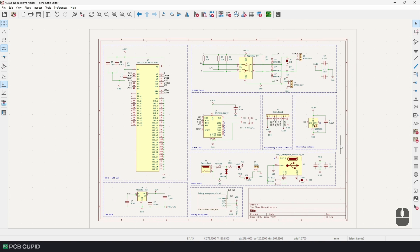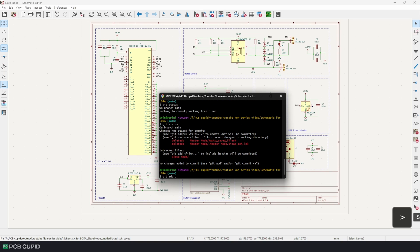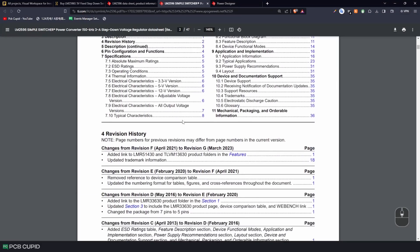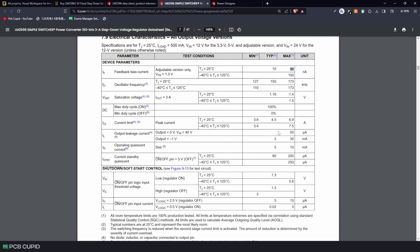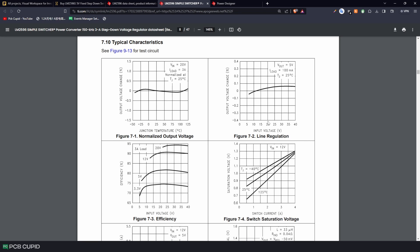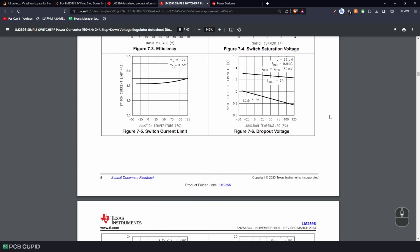To complete the circuit, just like the master node, I'll include a WS2812B RGB LED. This completes our slave circuit as well. Let me quickly save this project and commit it to Git. Here's an important note: it might seem like I'm just checking the datasheet for the circuit and building the schematic, and that's partially true, but there is a lot of electronics involved in the selection of circuits and component values, which sometimes requires a thorough read of the datasheet or understanding of the basic working of the features you're trying to implement.